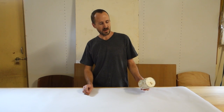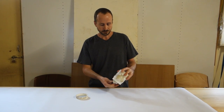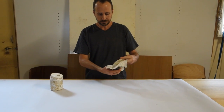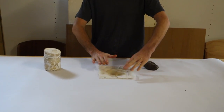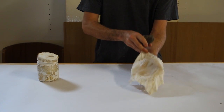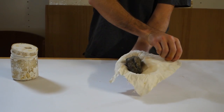First I'd like to show you how you fold the rubber for French polishing. It's important to know how to fold the rubber correctly so the cloth is nice and tight over the wadding. We start with a piece of cloth about six to eight inches square and you've got the wadding. I take the cloth cover and place the wadding diagonally in the centre, as you can see there.